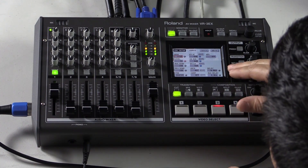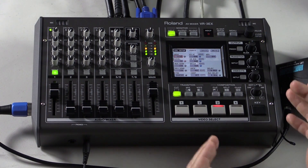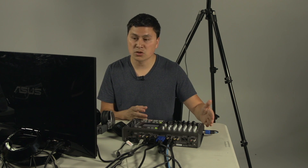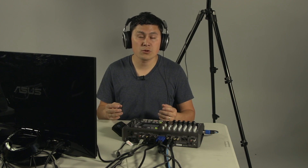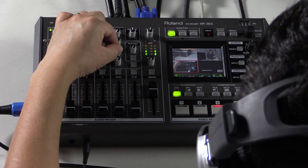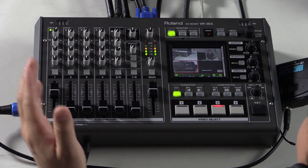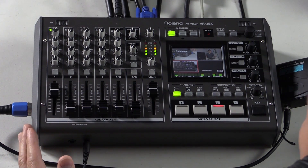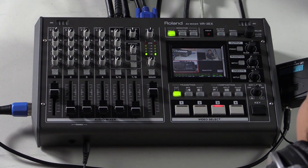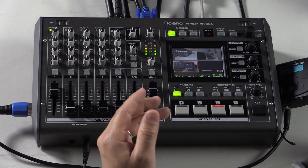In the bottom right corner of the audio setup menu is the delay. Audio doesn't always arrive at the source at the same time — that could be due to the fact that the speed of light is faster than the speed of sound, but also due to audio processing some signals may arrive sooner or later than others. You might notice that the HDMI audio comes in with a little more delay than an audio source plugged directly into your video switcher. To demonstrate this, I'm going to turn on an HDMI audio source from a camera located only 6 feet in front of me. If I turn up HDMI audio level 3, you can start hearing a delay because the HDMI signal has a bit of a processing delay. So what I'd want to do is delay my XLR audio input to match. That's one technique you can use if you experience this type of echo effect.